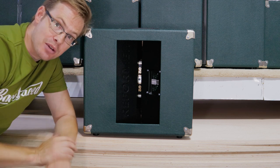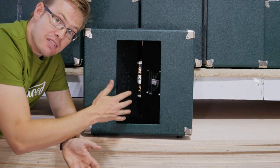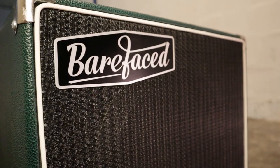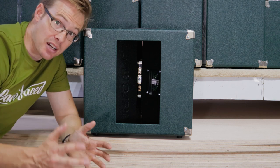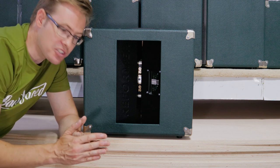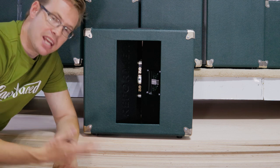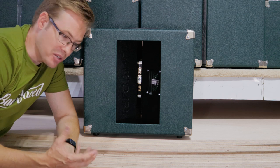And it will add this other sound to it and make it sound bigger. And because that sound, due to the AVD, will have spread and hit the walls and come around to us, we will hear the sound with the clarity that is often missing when we're not in the line of fire of a speaker. Because a guitar speaker — especially a bigger guitar cab like a 412, but certainly a 112 — it's a big speaker. If you want frequencies to disperse you want smaller speakers, but if you play guitar through a tiny speaker or a little dome tweeter it will sound tinny, thin, horrible. So we can't just add a tweeter to help dispersion at high frequencies because it messes with the sound.